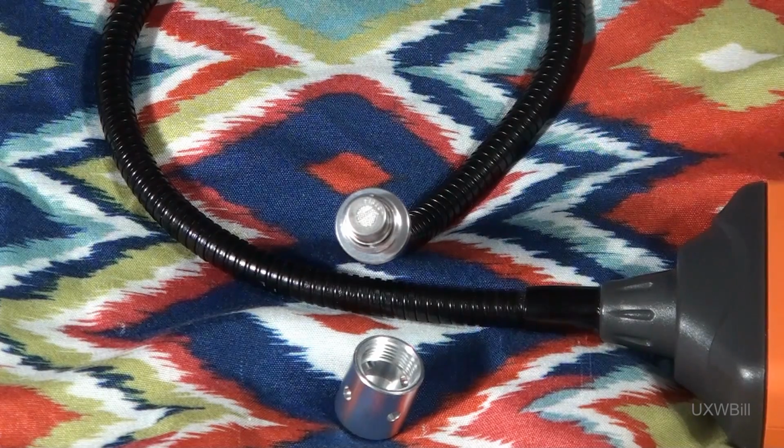Also, although it is not the primary purpose of these leak detectors, if you are searching for a flammable refrigerant of any kind, such as isobutane, propane, or even refrigerant 32, to name but a few common examples, you can in fact use these TopTes leak detectors to do so. However, they are not designed and may not detect regular refrigerants that are considered to be non-flammable.